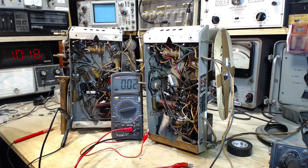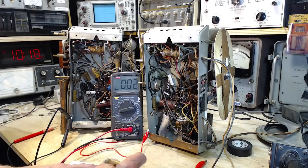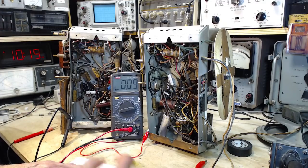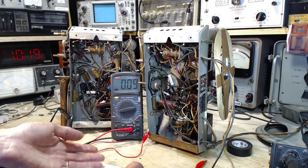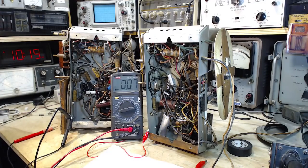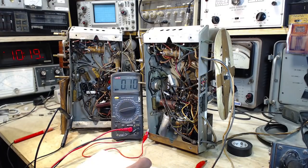Well, we don't have to bank it, we can calculate it. Oh no. Another calculation. I gotta get a calculator in here. So if we're looking at 400 ohms, 16 volts over 400 ohms. Oh my gosh, I think I can divide this out. So it's 0.016 divided by 0.4, which will become roughly double plus a little bit. So 16, 32, say 40. So 0.04, or 40 milliamps. I get 40 milliamps, 400 ohms. Oh, wait a minute here. That would mean 10. I don't think I did that right. Okay, so I just double checked with the calculator. Yeah, I got it right.